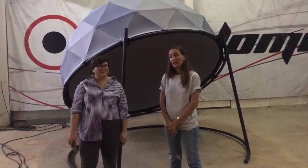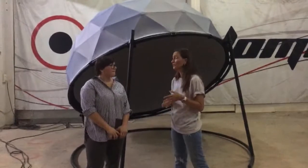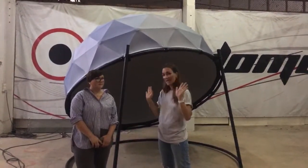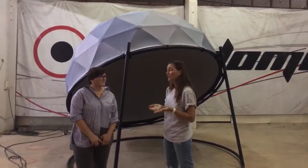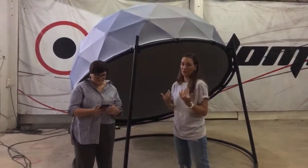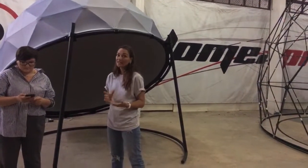In our manuals, we usually give the information for your maintenance crew, if it's a fixed installation, a big installation. When you come to the dome, the only maintenance you will need to give to the dome structure is just to have a look visually, to see if it's not deformed, if it's nice and cool, and the screen is really cohesive, no wrinkles or anything. So basically, when you look at a well functioning dome, you won't even be able to say that it's actually fabric, that it's not a hard shell dome, right? So everything you need to do is come over, check it, then check the fan, and the switch to the backup fan, if one is not working, will be done automatically.